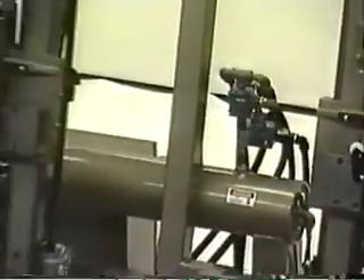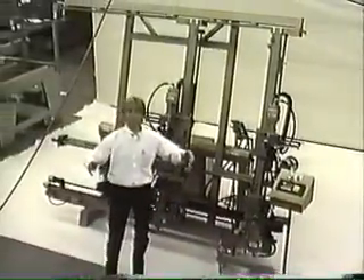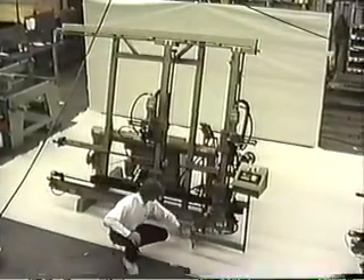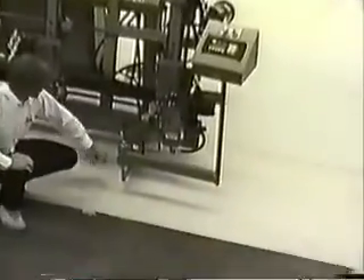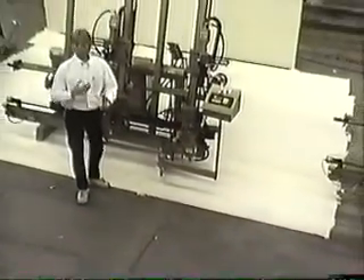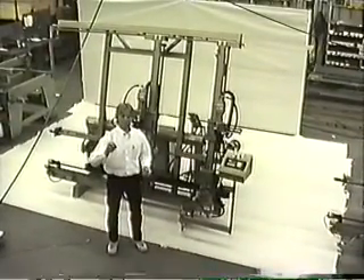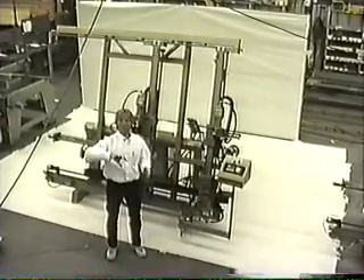This is the tilt window machine. It's part of our Ruvo product line of our millwork. This machine actually comes with an installation — a service guy comes and installs the machine for you. It's also got a series of leveling feet, four total, located at the bottom of the machine. It needs to be anchored to the floor, get it into position. As far as air lines and how much air is required, we're looking at around 100 PSI generally. Please look at your manual as far as how to get air to it — we want to try and run it with as big a line as possible.